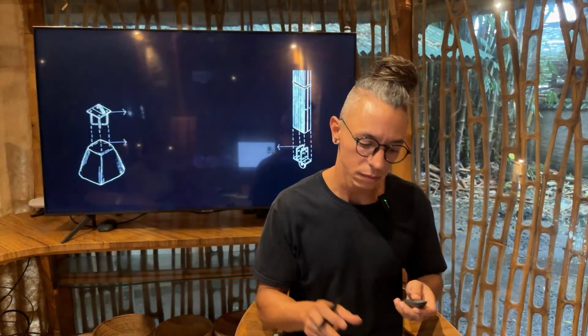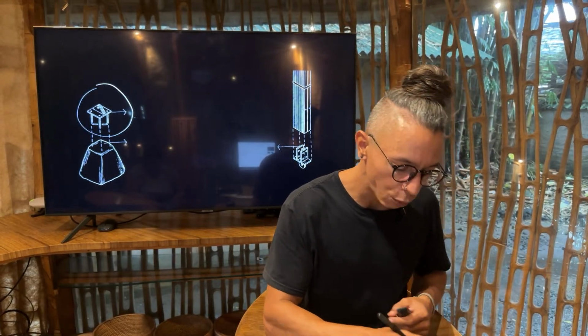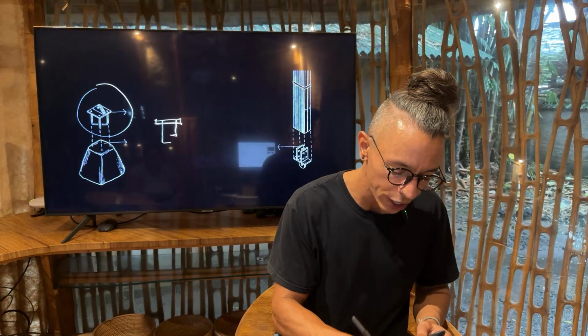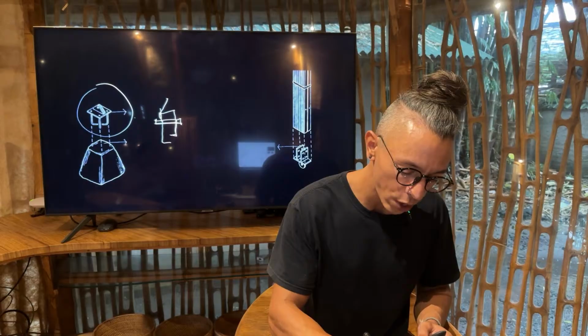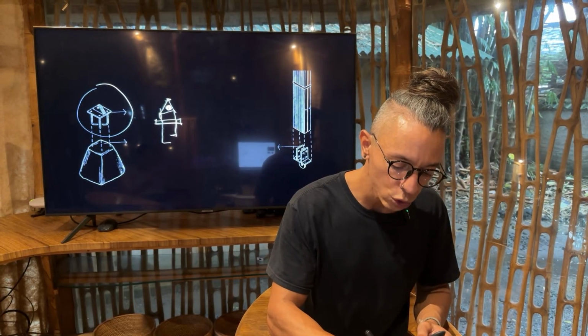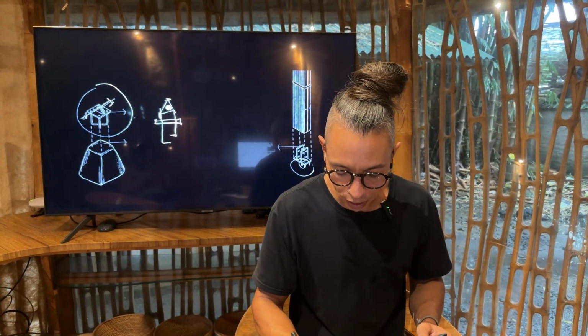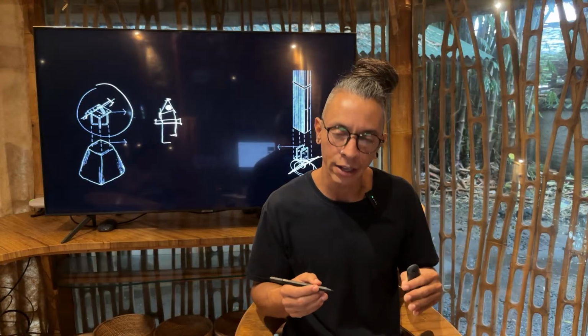The previous sketches were like that, having two different components. One is inserted into the laminated split, and then the other one goes directly to the concrete foundation, and they are tied just by one bolt. So think about two different groups. This is the first group that will be inside the concrete. If you look at the section, it is a steel plate that has some anchors going down into the concrete, and with this steel plate there's a small drill here. This particular drill that is going in this direction needs to meet the group B here. That's where you're going to put a bolt, and that will allow you to articulate the entire structure.